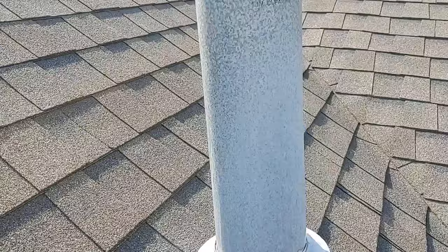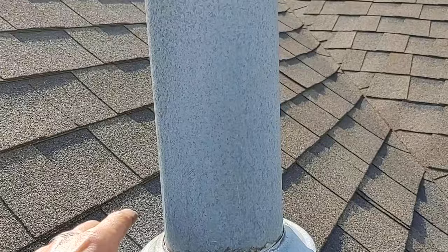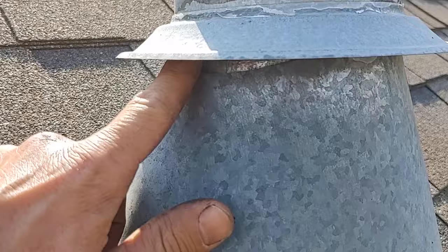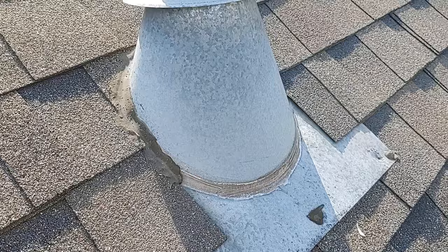I get out here and look at it. Everything with the vent cap looks fine, minus a little bit of hail damage. This had some caulking around it — I just took it off. It looks like the pipe itself was raised up ever so slightly and there's a nice gap right here. It's close enough that on a heavy rain hitting this and splattering up, it's catching the pipe under here and just trickling down the pipe, running in — and that's where he's getting water on his furnace, thinking that was the issue.